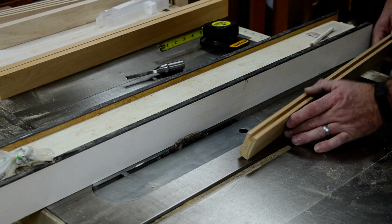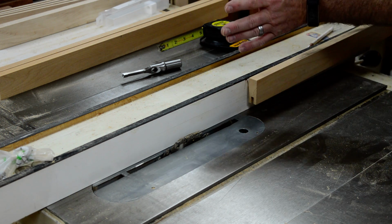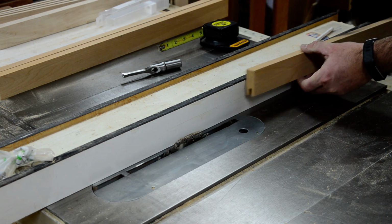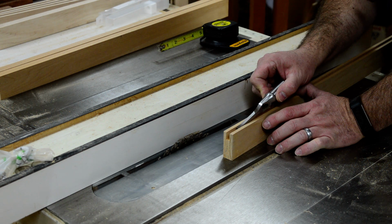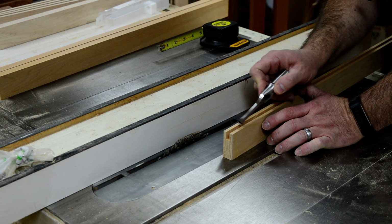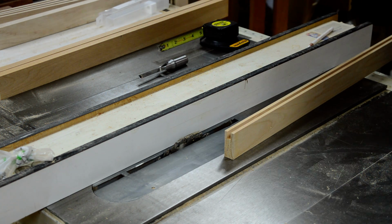And you'll notice that on that last cut, so let me back up. The first cut after the adjustment, I went all the way through, and then I flipped this around, did a little cut, and then pulled it straight back. And that is going to give me a true sense of where this dimension is at. And so, yeah, it feels pretty nice, actually.